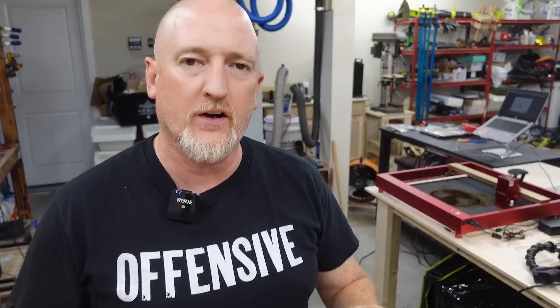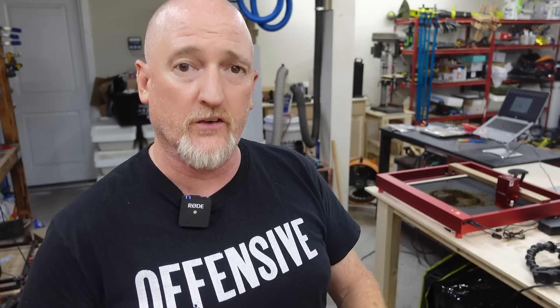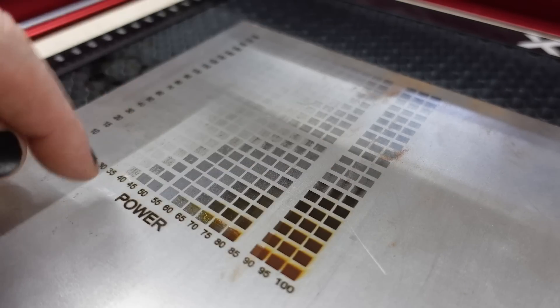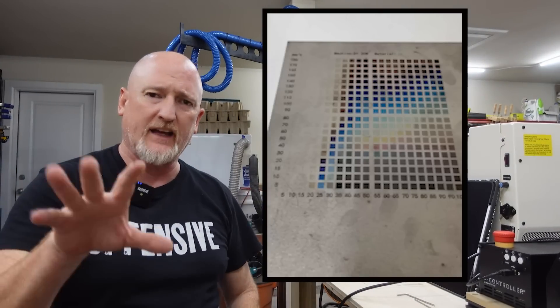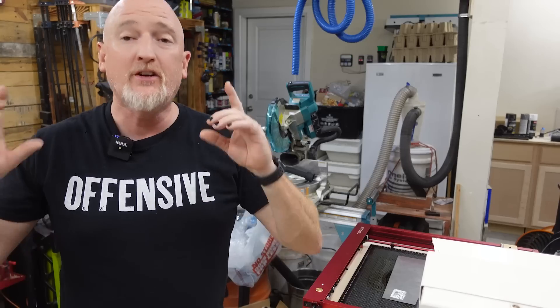I know there's been a little confusion out there on an email that went out, or some sort of communication that made it sound like the laser can engrave in color. It can, kinda. What they're referring to is with the 20-watt unit, you actually can oxidize on metal and change it different colors. Here's the test row grid I ran — we're going to ignore that I accidentally skipped the row for 85. But you can kinda see some of these different colors. They got some really good blues and reds in their example, and that can totally be the type of metal. If you can nail some of those colors, we're going to see some really cool projects.